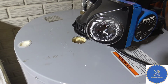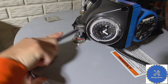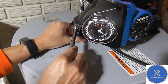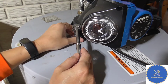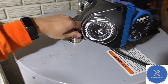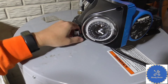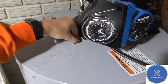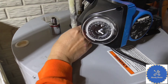Now we should be able to use a shorter ratchet to take it out. Note that water may come out if you did not release enough water — if that is the case, go ahead and release more water from the bottom. Some water did come out for me, but it wasn't that big a deal. I released more water from the bottom — you may need to release something like two gallons instead of half a gallon. Now we should be able to take it out. You can see it's metal but it has a lot of deposit on it, and they are yellow in color.